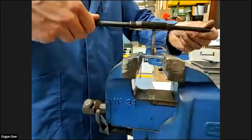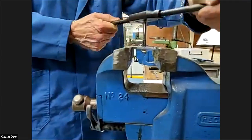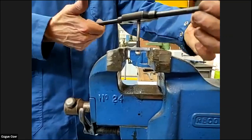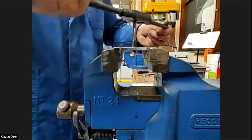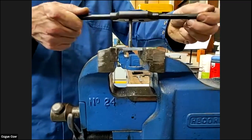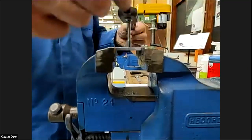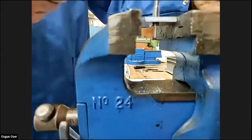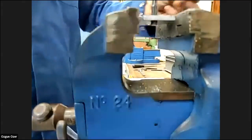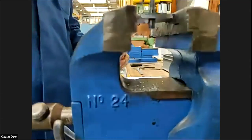So from there, half a turn, quite hard that, it goes back, easy, and then suddenly I come to some resistance, I just break that chip off. I can go back to my start, so half a turn. Easy. So you feel some crunching feeling, do you? Yeah, and then that's just catching there, so I'm just going to break that chip and go back to my start. So again, half a turn, quite. Come back, break the chip off. Again, half a turn. I don't know if you can see it on the camera falling. It's going quite easy there, and it just spins round now.